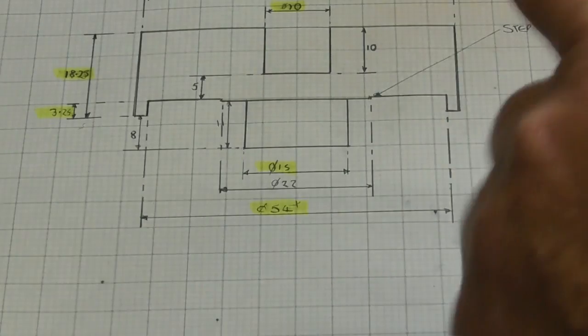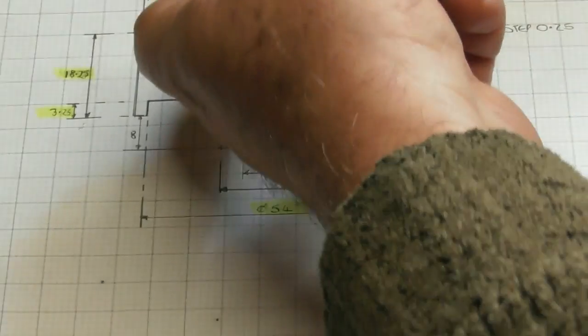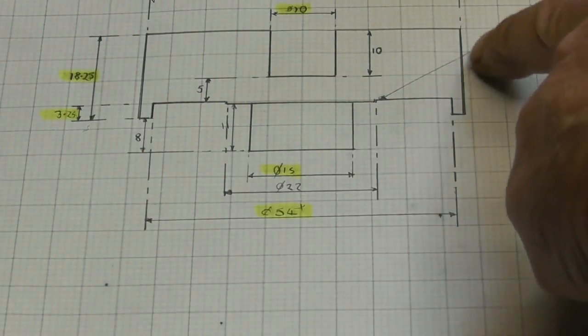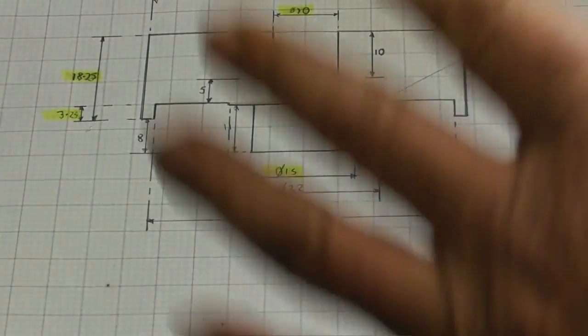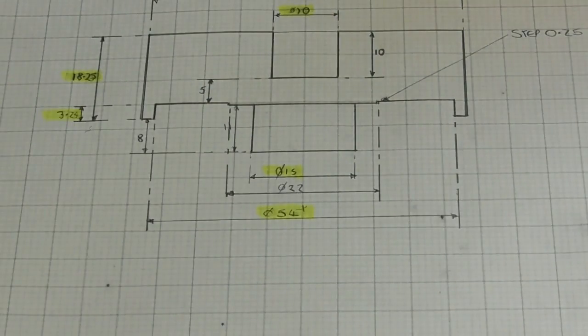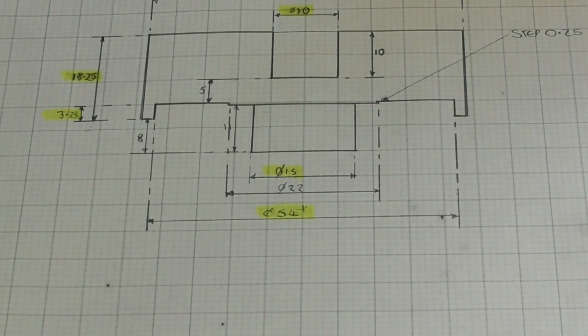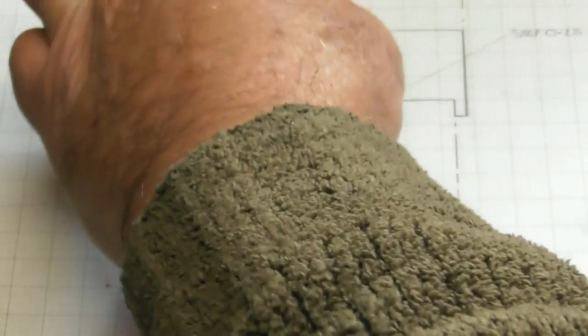Now, I've gone for a diameter of 60 mil. Eventually, it'll have a 10 mil slot. There's going to be a tapped hole up from the bottom, and tapped holes from the side to hold the turning tool, that sort of thing. But that is a basic drawing, and maximum theoretical will be 30.5 diameter, so I've kept all the heights quite low.